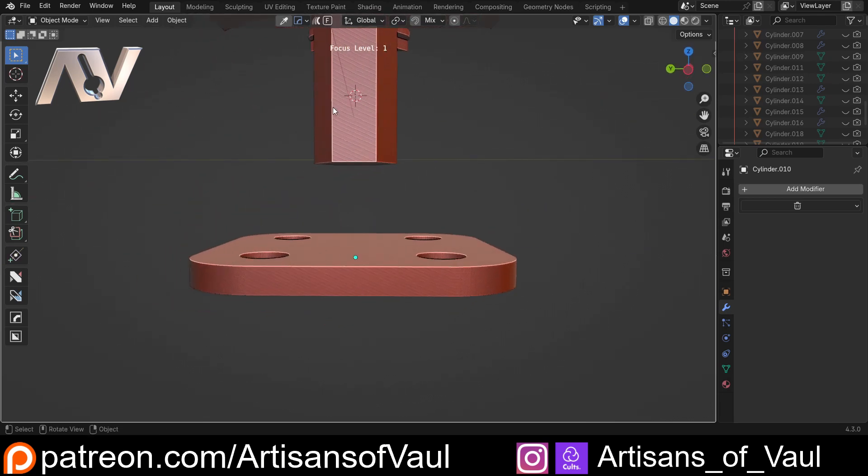What I want to do is put a nut in here which is going to be screwed into, and then have the screw go through into this other object. These will be butted up against each other. I'm going to need to add the hole in the bottom, the space for the nut in the top, and a hole somewhere here for the screw. Importantly, I'm going to need to put the nut into the print as it's printing.